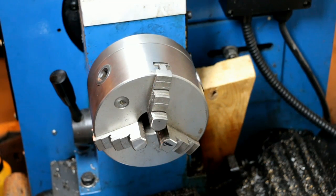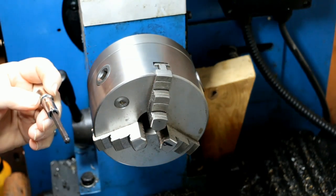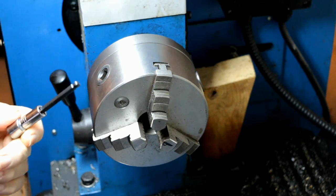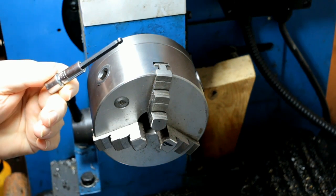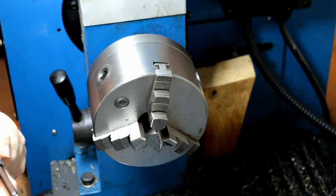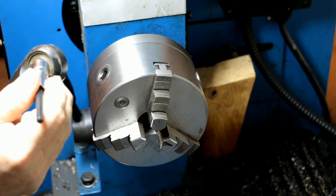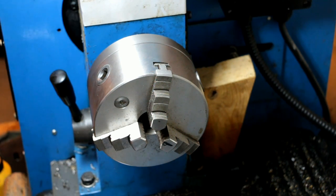One of the things I came up with was a way to adapt — a ball-end Allen wrench. I cut off the L and stuck it into a socket adapted to 3/8 to go on to an air ratchet. I still have to use a stubby to break loose the Allen bolts though.